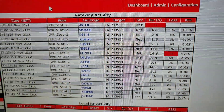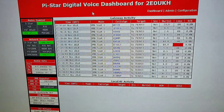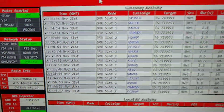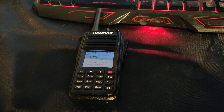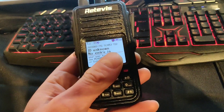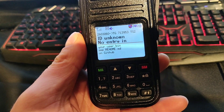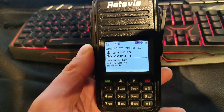On the dashboard you can see all these guys talking, and it comes up with the target talk group as 713953. That's the key number — you've got to put that seven in. Once you've got all those settings in, it will say what you're linked to. I'll show you the settings on the radio. You've got to enter that number seven and then the number from the drop-down list — 713953 for example.